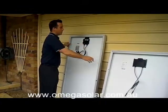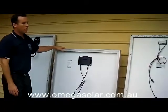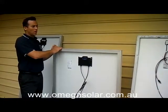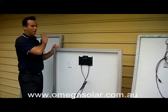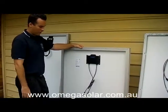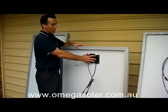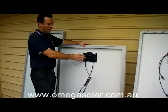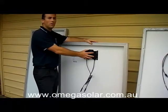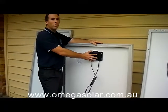It is a good panel but it is their Chinese one. Then we've got the last panel I'm going to show you today which is Conergy's Power Plus panel. This is made in Germany in their state of the art facility in Germany. The difference between this and even their own Chinese panels are vast. This particular panel has a junction box with what's called passively cooled bypass diode technology, which basically means in layman's terms that this box in higher temperatures will operate cooler.